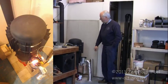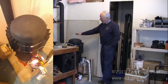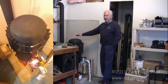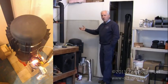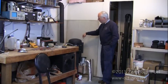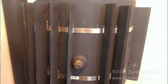You will also notice that I have added fins around the perimeter of the top of the tank. These fins add an additional 700 square inches of heat-dissipating surface area that allows the heat exchange to get into the room and keeps the rest of the system much cooler than it used to be. These fins are again pieces of aluminum drip edge, spray-painted black. I ground the corners to allow the stainless steel banding and clamps to slip through and clamp to the tank.